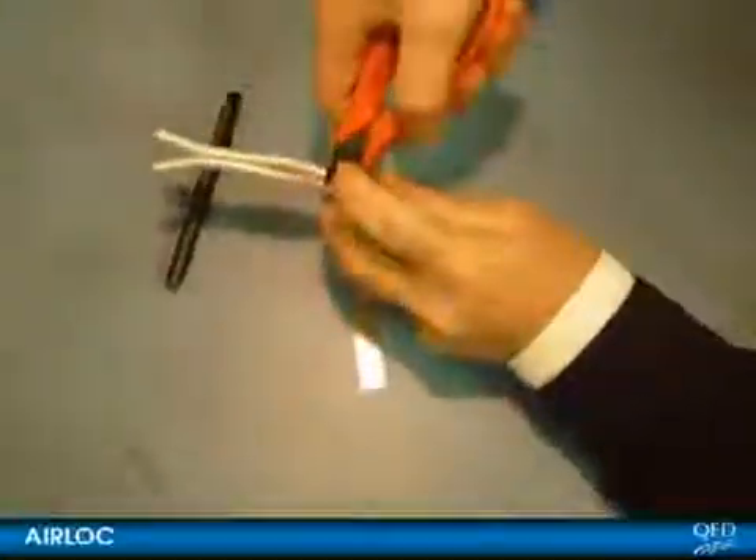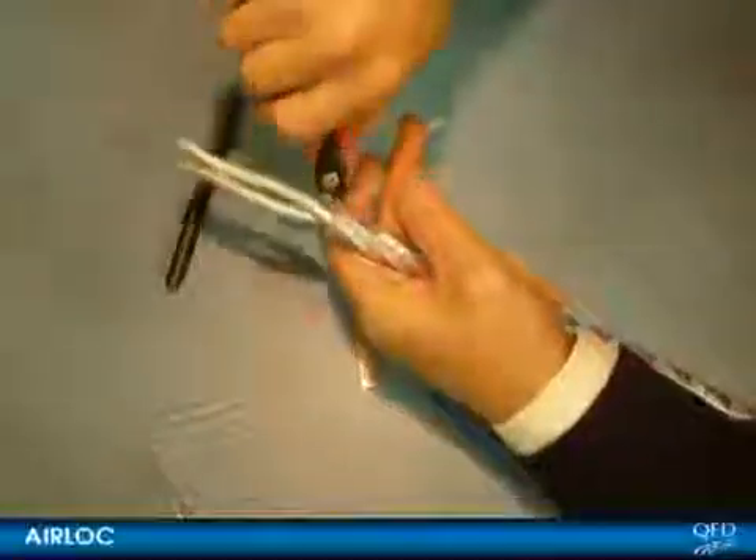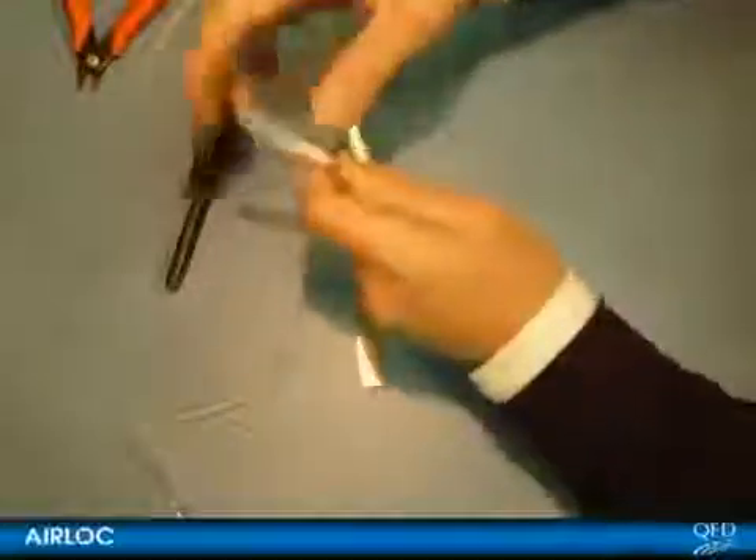Remove the clear mylar wrap and snip it away cleanly at the base, then untwist the spiral construction and separate the two conductor bundles and the spacer rods. The polyethylene spacer rods must also be snipped away right down to the base.